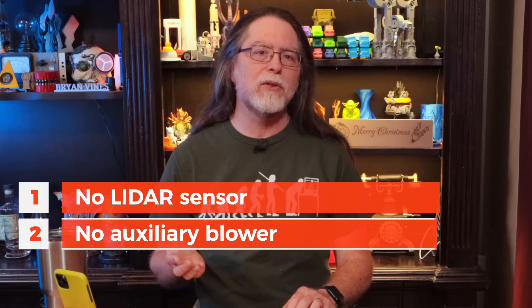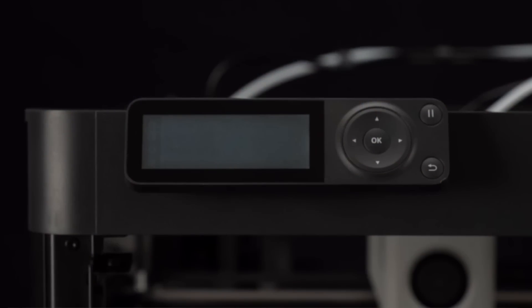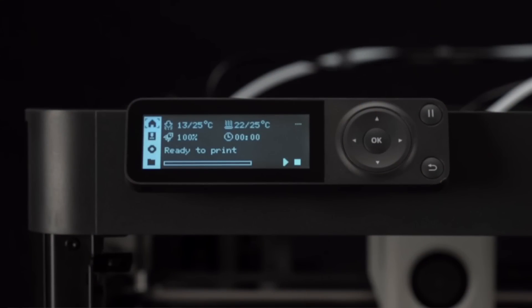Was it a bigger printer? Was it smaller? How was it different? As it turns out, the P1P is, in some ways, a stripped-down X1, but it also has some value adds that make it more than just a minimum viable product. Let's talk about what's been removed from the X1 to get to the P1P. The most obvious thing is the lack of exterior panels. The next most obvious thing is the lack of a glass top panel and the glass door on the front. Less obvious are the lack of the LiDAR sensor array on the toolhead, the lack of the big auxiliary parts cooling blower, and the omission of the camera and the light bar that let you monitor the print remotely. And the touch screen has been replaced by a monochrome bitmap display with a circular button panel.